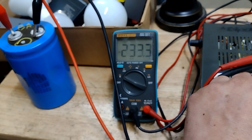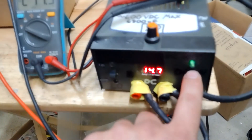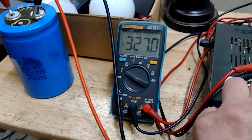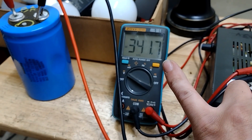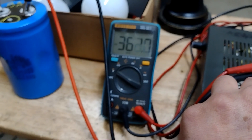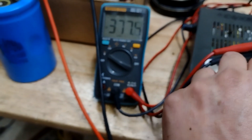You can sit there and watch it basically get up to 400 volts fairly easily — that's sort of the idea. You can see how it climbs. It's being loaded by the neon, but it's interesting to see this cap actually charge to its voltage. In the end I'm going to use about two of those in series, which means each one of these is only going to see about 300 volts tops — maybe even only about 250.